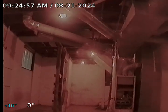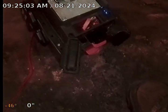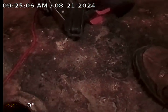We're going to point over towards the stairs. There is a PVC cleanout underneath the stair tread, and it's also tied into the vent that goes outside. It does look like a Y. And there's also a PVC cleanout underneath the porch as well. It appears the sewer goes out the back of the house.